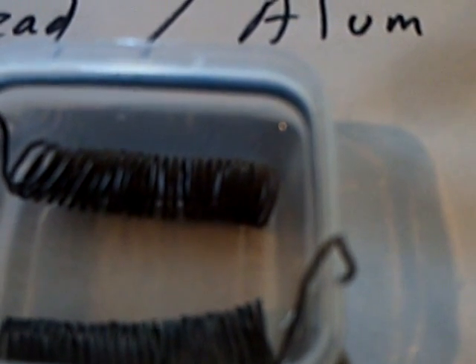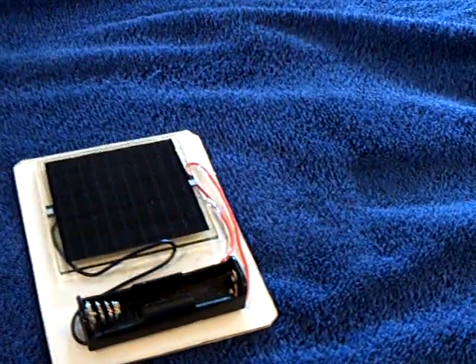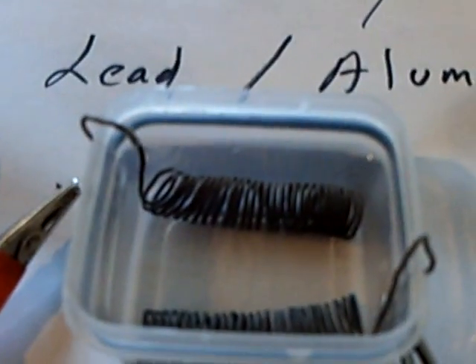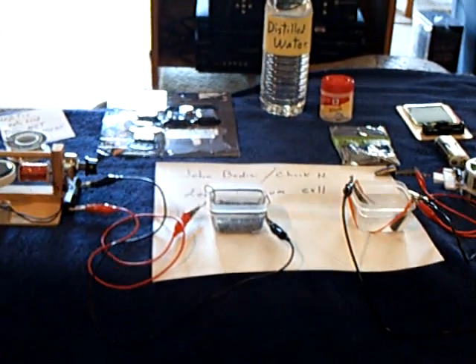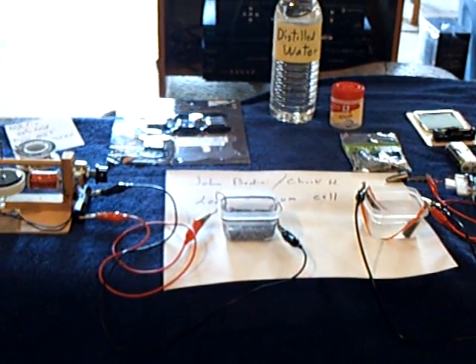I'm not seeing any deterioration — there are no deposits falling off. If you zap this with too much current it bubbles and electrolysizes, so you have to keep the current down. That thing puts out about 70 milliamps at about 3.5 volts, and you need 3 volts to charge these 1.5 volt cells. Before you guys buy the big batteries and spend a lot of money, you might spend a couple of bucks on solder — if you can find that 50-50 — and give this a whirl. Thanks for watching.